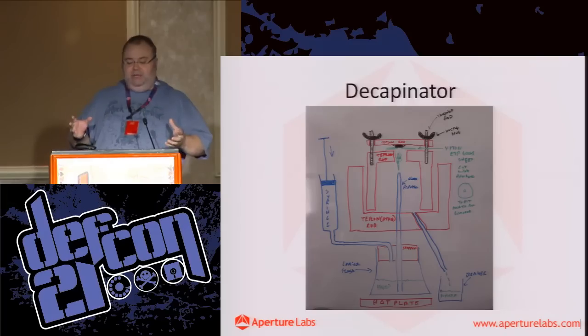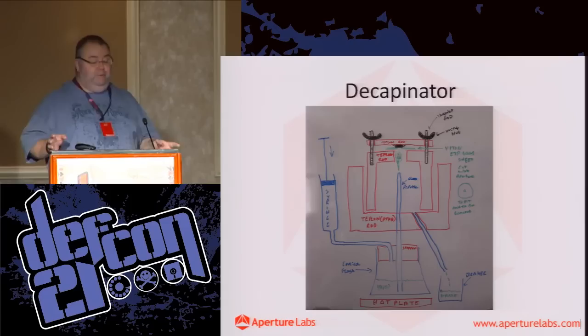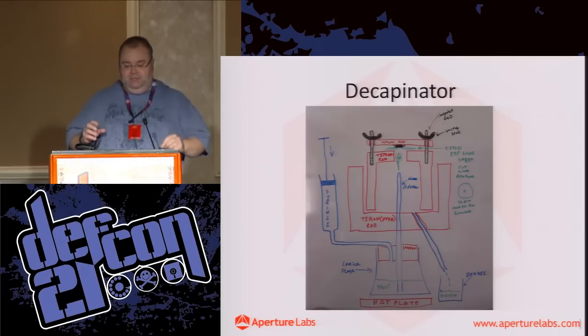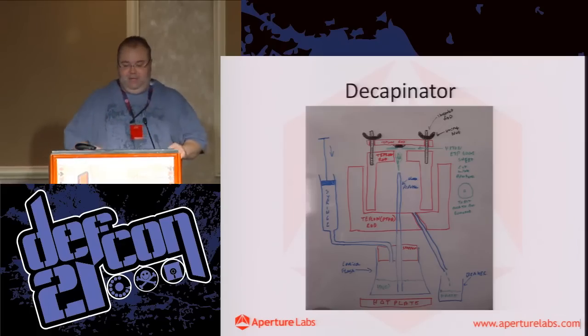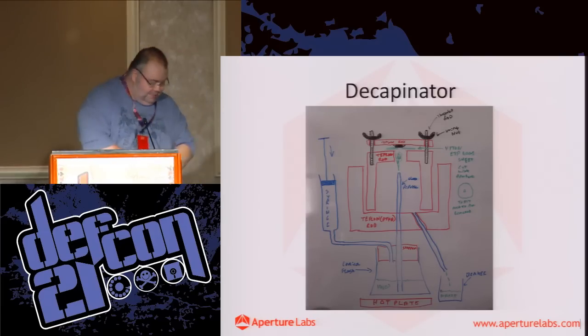And I wanted to try and use simple tools. So this could all be done with a drill press and just some simple woodworking bits. And the Teflon cuts like a dream if you use woodworking tools on it. So I chopped out these two cups. I drilled a hole through the bottom. I learned a little bit about pulling glass pipettes. It is simple unless you want the pipette to be absolutely straight, in which case it's a pain in the arse, but it's doable.